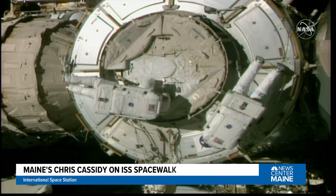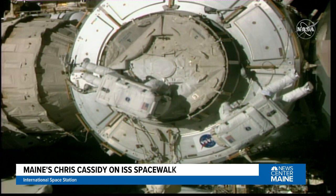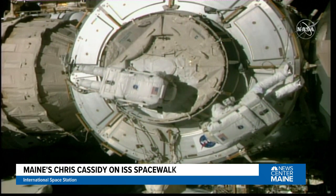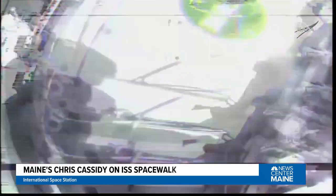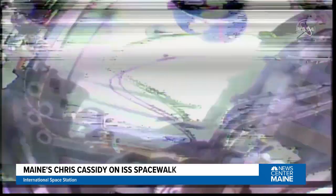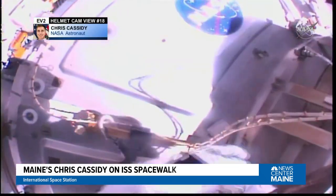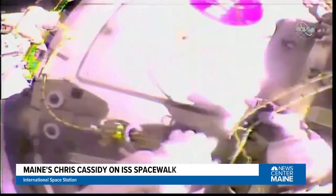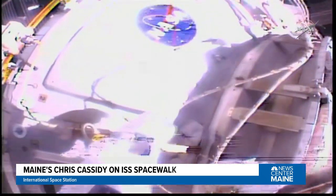And Bob, I see you already over the center disk cover. We're going to be looking to pre-install one long wire tie on the Zenith CDC handhold. Okay, first I'll put the cap on, if that's okay. Sounds good. It can mate to any cap. Okay, there's only one available cap here. Roger. And then you want me to pre-install a wire tie to the Zenith. Good words, Bob. Zenith, CDC. You can see the handhold. And the long side of that wire tie, we want to bias towards the CBCS opening.